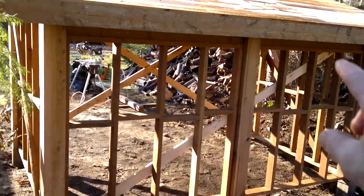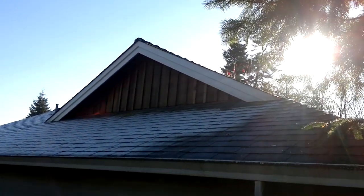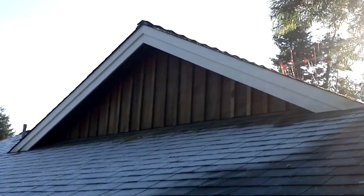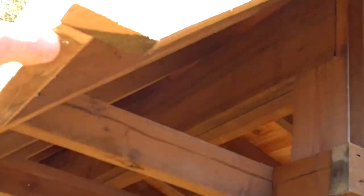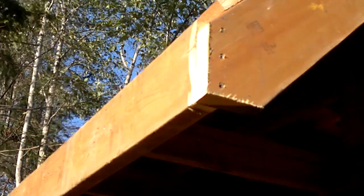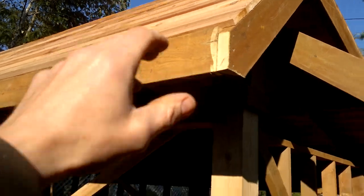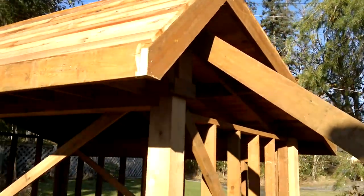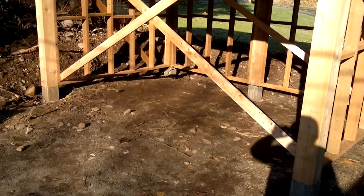So with the posts in the middle, it's going to be nice. We're going to have 2 panels of the hardy board. We'll be putting eaves trough, and if you look up in this peak, I'll show you here, zoom in. So we're going to be matching that for our side here. Up in our roof, we're going to do the same thing. And over here, you're probably getting dizzy. Down here, we're going to have it hang past there about 6 inches, and that way it will cover the ends of the eaves trough. We're going to put a trough on the front and then a downspout diverting the water to the back. Otherwise, you'll have a big groove that will get worn in there from the water constantly dripping.